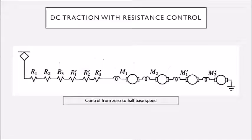The figure in front of you consists of four DC motors, and all the motors' fields are connected to the armature in series connection. That is why those motors are called DC series motors. We have four series motors, and to make seamless operation we have to make pairs — one on the left side and one on the right side — so that each pair gets equal voltage, equal speed, equal torque, and equal everything.